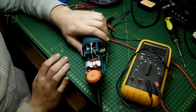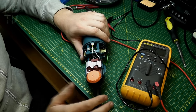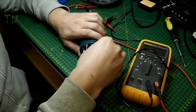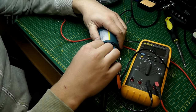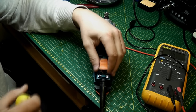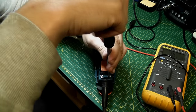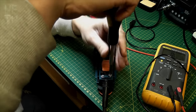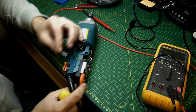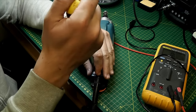So it looks like it is going to be the electronics. I'm going to try and get this control board out and have a closer look. It's not fully potted - it's got a conformal coating over it. Before I take the board out I'm going to remove the two screws on the cord grip because they look very long and I suspect they go through and hold the control board in place.